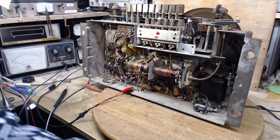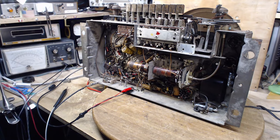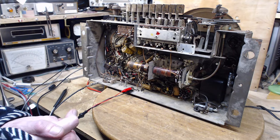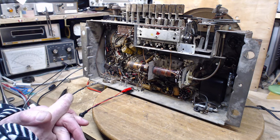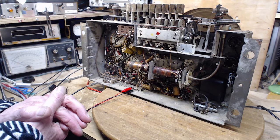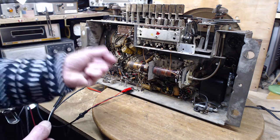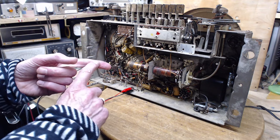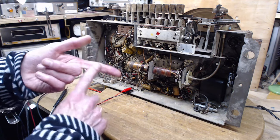Too hot. Now, what do I do? Do I let this run and see what happens to the field coil? The assumption is the field coil is carrying less current, but is that necessarily true? I don't know if that's necessarily true, putting a bypass in. Get a very, very strong power supply. It's going to put out 200 volts no matter what load you put on it. So you have a field coil on it, and then you add another resistor. This won't change. It'll stay 100 if you have a strong power supply.